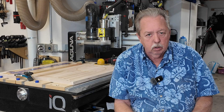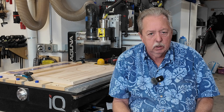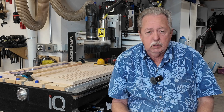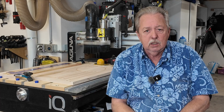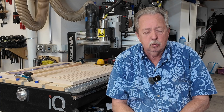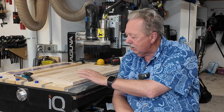That's it folks — I just wanted to make a quick video focused on how to flatten a board, especially one that has rocking in it. There are a number of ways to flatten your board: you can use your joiner, a planer, or a planer sled. In this case the board had a lot of twist, and when they have a lot of twist I find it easier to use my CNC because I can properly shim under the right areas to get it solid and then run the surfacing bit over the top. I was using a surfacing bit from Rip Precision Tools — I'll put that information in the description.